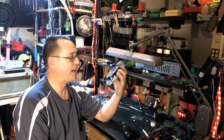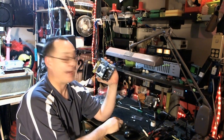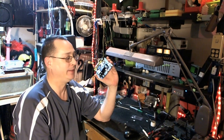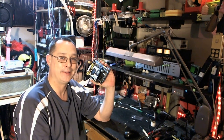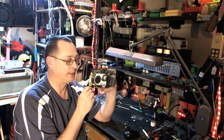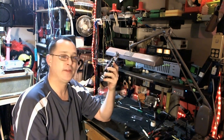I had the regular electrolytic cap in place of the one that had failed recently and it worked fine. Three of these failed and it was still running — when that fourth one went the day of the War Commander event, that's when it pooped out. You don't really want to be running your stuff when it's got bad parts — it could put stress on the motherboard or the power supply. Speaking of power supplies, I understand that's another source if you're a hacker type who likes recycling.